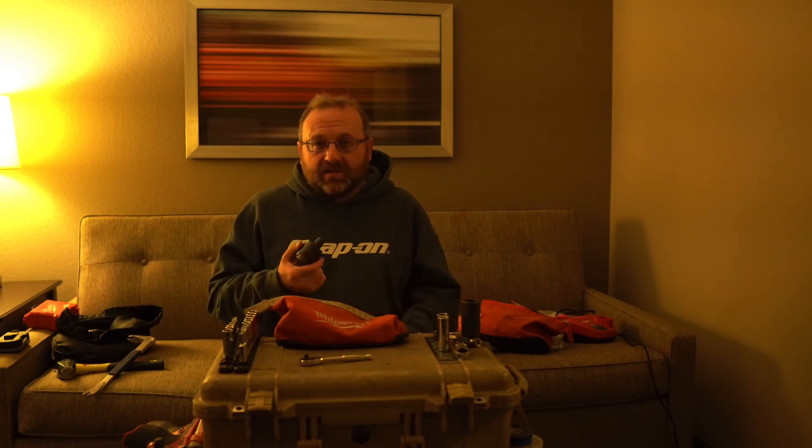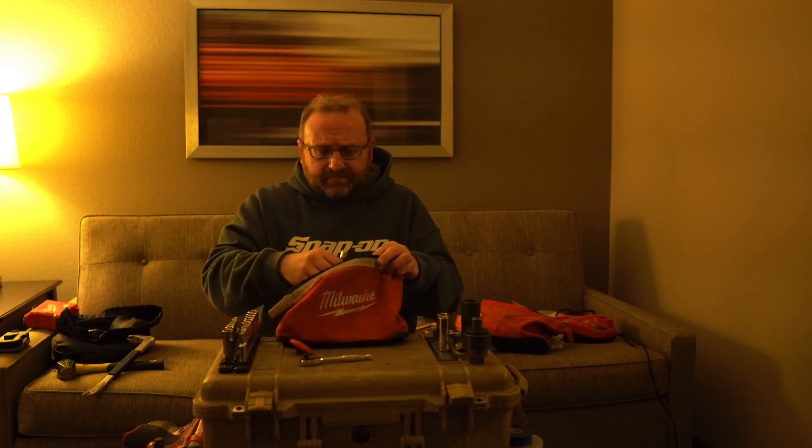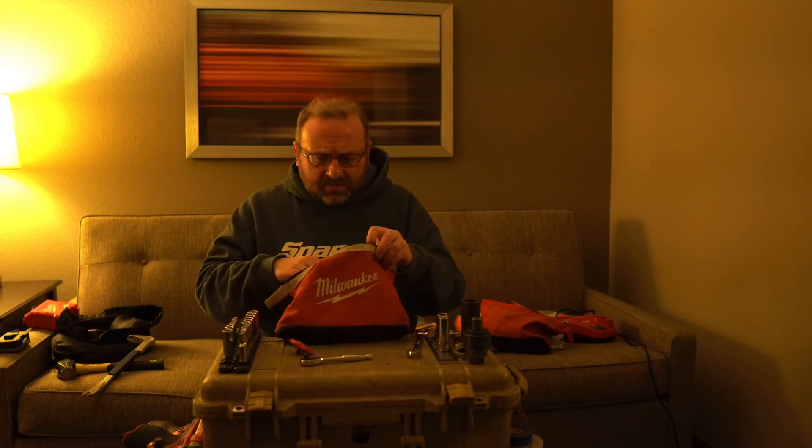There's a one-inch Snap-on impact socket, half-inch drive, which goes along with a knockout punch. On the stuff I'm working on we put in a big self-sealing grommet — we call it a NEMA gland — and we have to put a 40mm hole in. It's hard to find a 40mm hole saw and they wear out quickly, so I carry this: drill a seven-eighth hole, use the impact socket, and it pops right out making a nice clean hole fast. Also got a couple of little spinners, extensions, more ratcheting wrenches, and bit adapters for the quarter-inch hex.